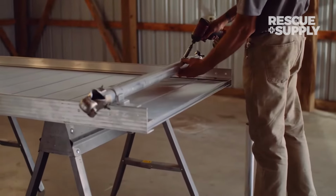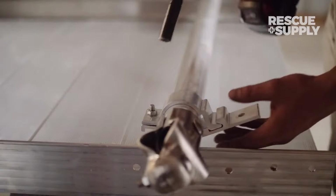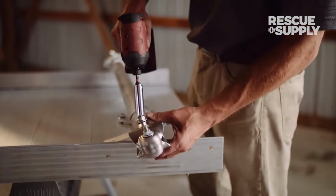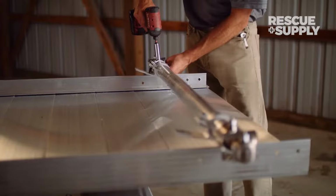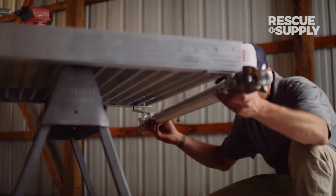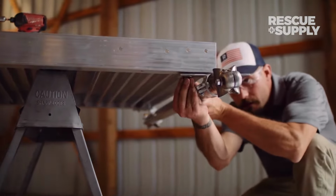With the crossarm assembly resting on the ramp, loosen the hex nuts located on both stringer brackets, allowing the brackets to rotate freely on the crossarm. At the same time, loosen the hex nuts on each leg clamp, located at both ends of the crossarm assembly. Move the entire assembly underneath the ramp, threading the 2 existing carriage bolts through the stringer brackets and securing them tightly with the washers and hex nuts removed previously.